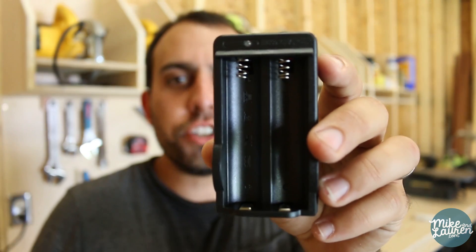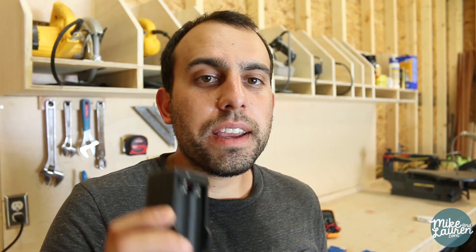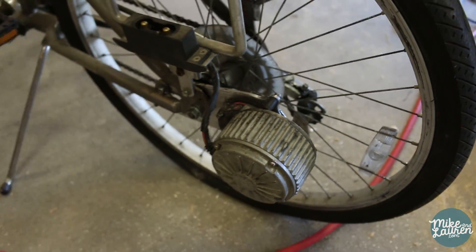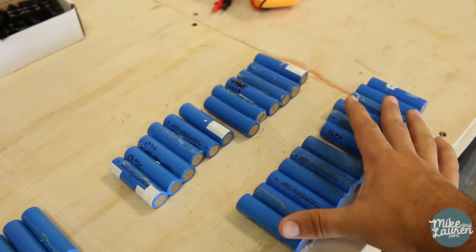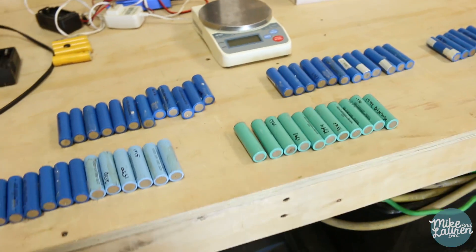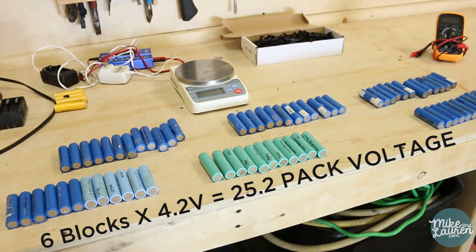There's an easy way and a hard way to do this and I chose the hard way. The easy way is to order a bunch of two-dollar 18650 chargers off eBay, charge up all your batteries, use the IMAX B6 to discharge every battery, then charge them back up. I did it the slow way — charging, discharging, and recharging every individual battery with the IMAX B6 because I was waiting three to four weeks for connectors from China. Since my electric bike has a 24-volt motor, I'm going to wire each group of 12 in parallel and then take each block of six and wire those in series.